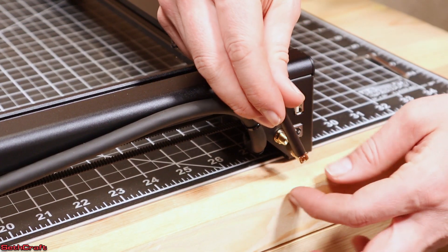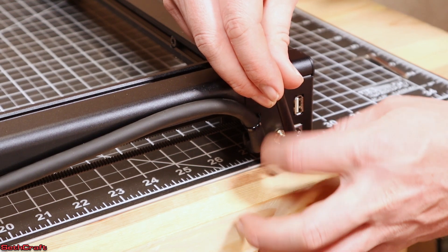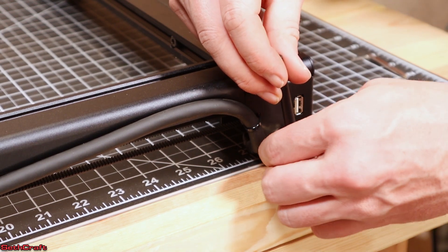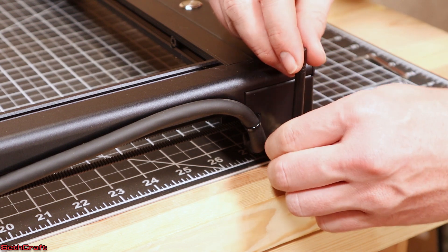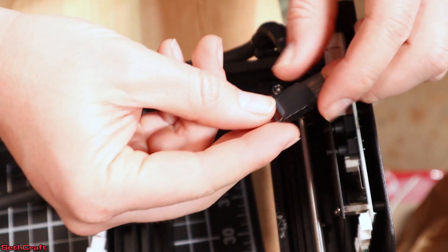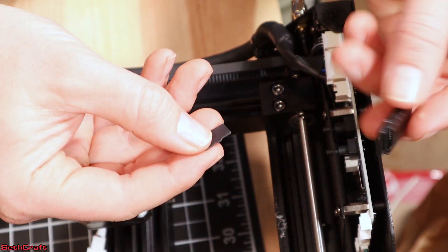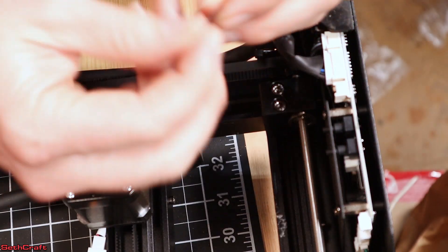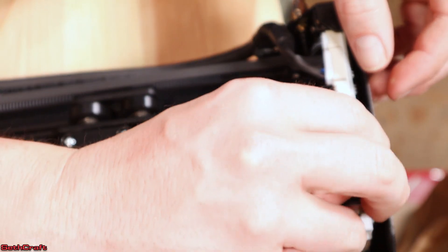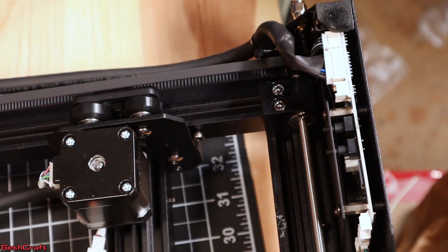The Wi-Fi adapter is installed over here on this side. I will most likely be using this entirely off of USB, but just for the sake of this install, let's check out what that looks like. Before operating the laser, you need to install the micro SD card, which is found on this little USB adapter. I'm going to take this and just insert it into the micro SD card slot and let that snap into position.